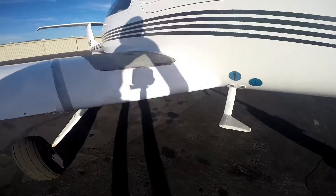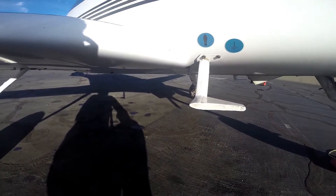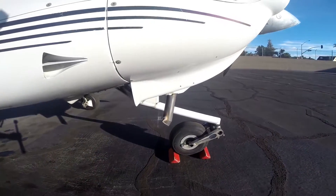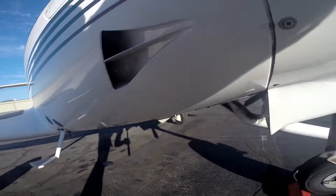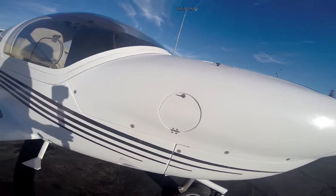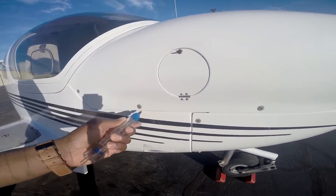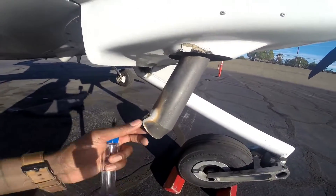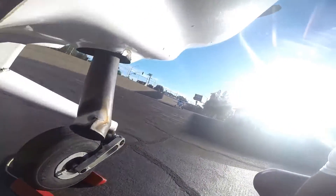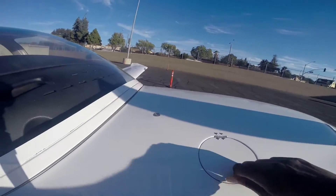Check your step on the right side — make sure it's there. Moving forward to the engine bay area: check the air vent on the cowling, make sure it's open and clear. Check the screws on the cowl — nothing poking out; tighten if needed. Everything looks good here. Check the condition of your exhaust — this one has a small crack but nothing major. A large crack all over would be a problem.